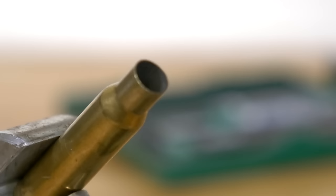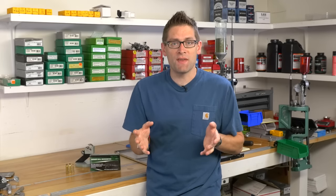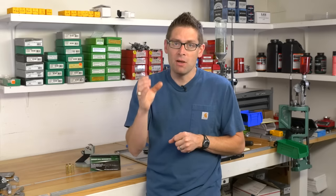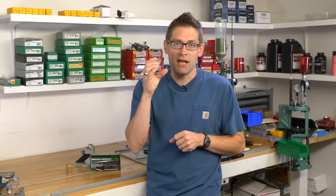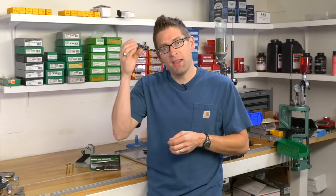A ball micrometer is typically used for two primary purposes. The first is to get an overall reading on your case neck thickness — the thickness at the mouth of a bottleneck rifle case. This is an important consideration if you're using things like bushing type sizing dies, because you want to have the perfect press fit for the bullet. You want about two thousandths of an inch interference fit between the case mouth and the bullet, which is going to enable you to optimize pressures when the cartridge is being fired and have more consistent pressures as well.